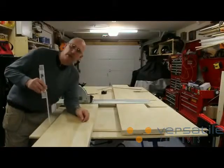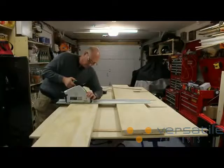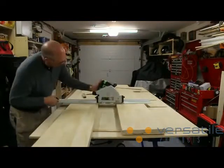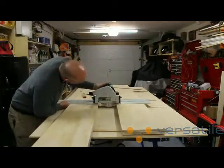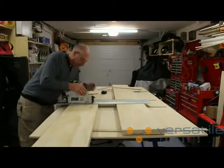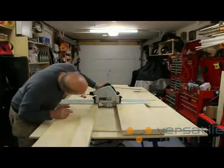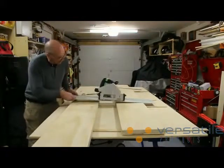About 41, 42 millimeters. Remember that the rail is here so we'll set this down to 42 millimeters. You want to double check it before it's plugged in. Bring it back up and get closer to 40 millimeters. That's going to cut through it without hitting the finish board that's underneath there.